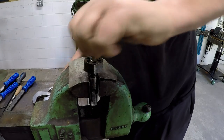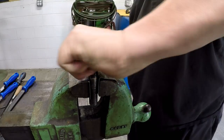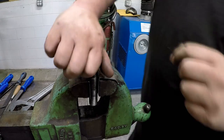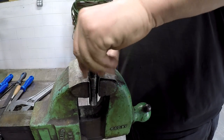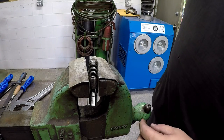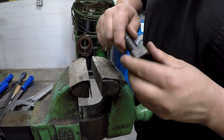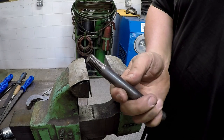It's still going to be a little snug right on that very tip there. That's just a regular old three-quarter nut out of the bin, but that'll work. It looks like there's some Loctite or something down in there, but there's an example of using a hex die to help get your parts back in order. I'll go ahead off-camera and run it down on the other side the same way, make sure those threads are all cleaned up too.